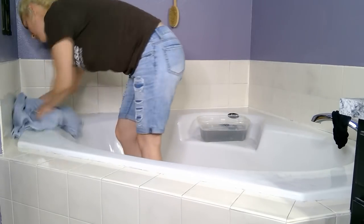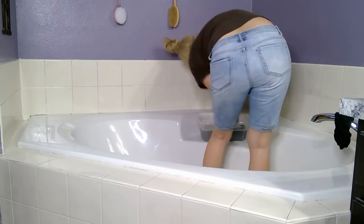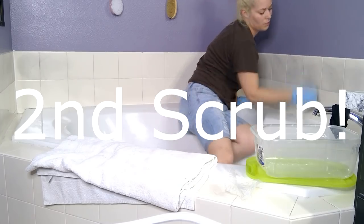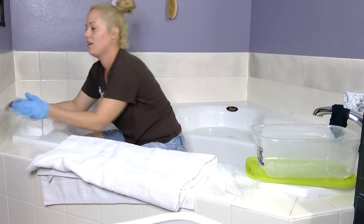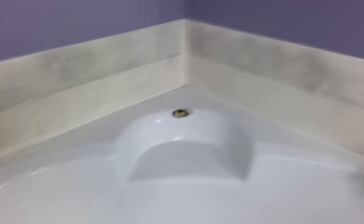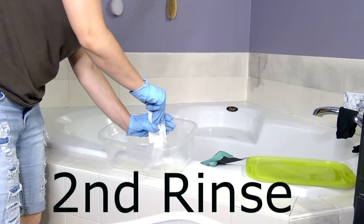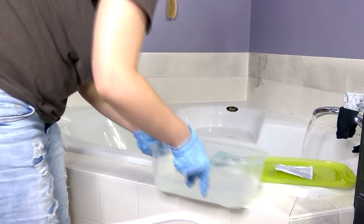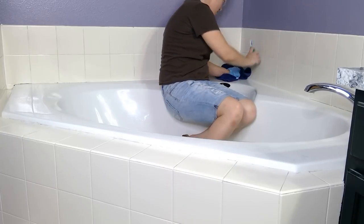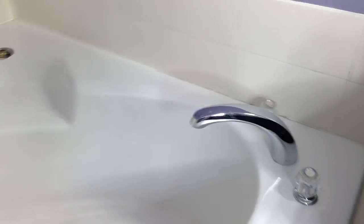One Brillo scrub down and now time to rinse with one round of the solution and warm water mixture that came in the box kit. Do yourself a favor while scrubbing with the Brillo or anything that's dark or stainable: try not to get it into the grout lines, because once you get it into the grout lines it's extremely hard to get out, and then it takes more paint coverage and more layers to try to fill that in and cover it with white.